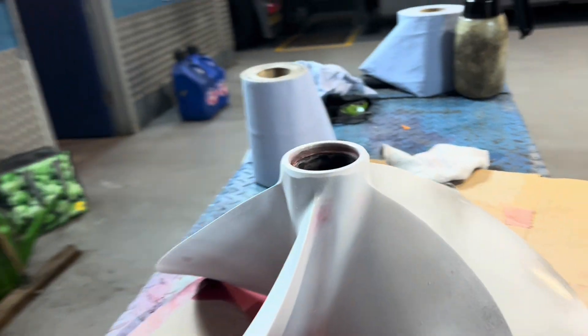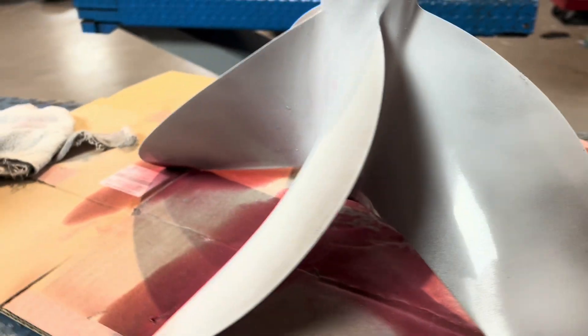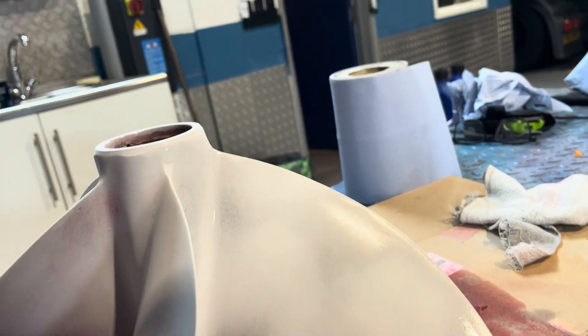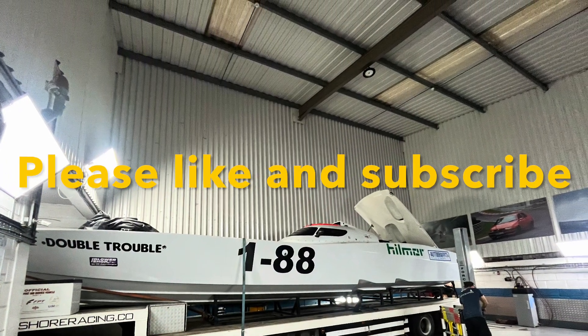This is the developer and I can't see — there's a little bit of red, you always get a little bit, but we're looking for lines and cracks, which luckily I can't see. We can clean these up and put them back in the box. This one's got a bit more red on it — again, no lines. Looking fine. That should be it — that's all for this week, don't forget to like and subscribe.